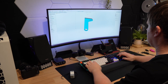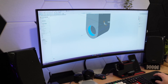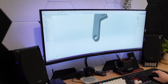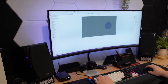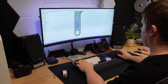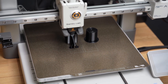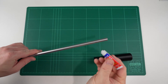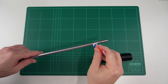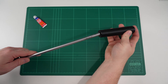Let's start with the printed design. First up is the lever. I don't think a fully printed 400mm long lever is a good idea, and it wouldn't fit on most printers in one piece anyway, so I'm going to split it into two parts — a base and a handle — and then join them with a bit of 10mm steel rod. I'm printing both parts in PETG on the strength preset. There's no need for hardened steel; even just a bit of 10mm threaded rod would suffice, but I already had this, so that's what I'm using.